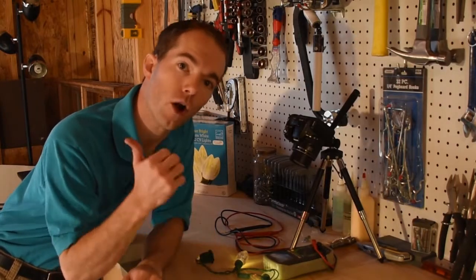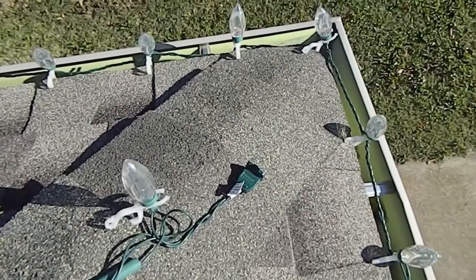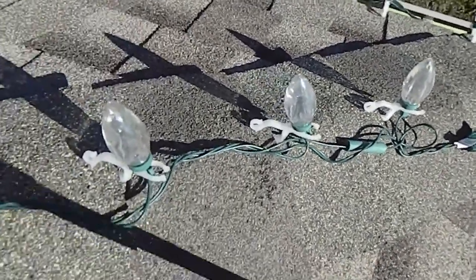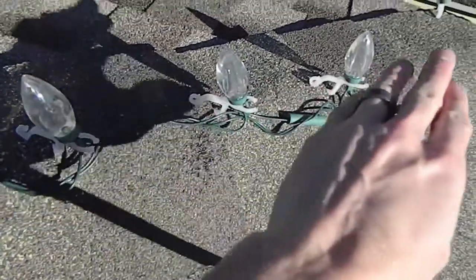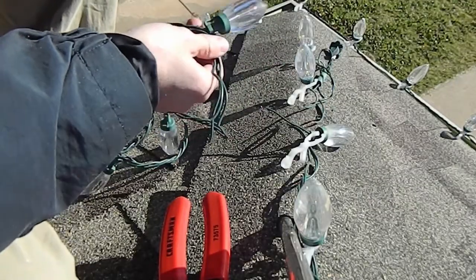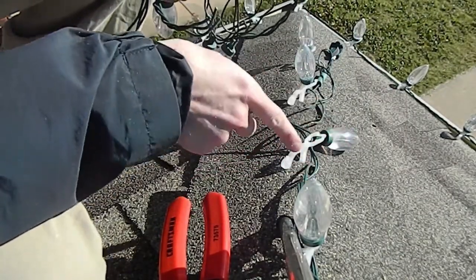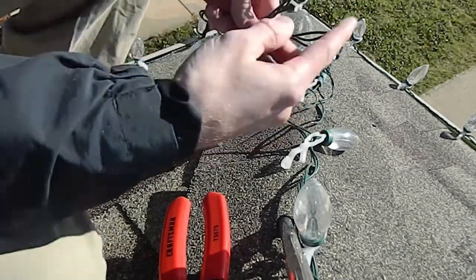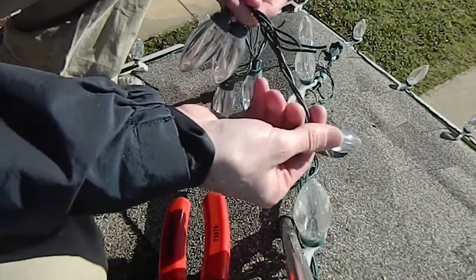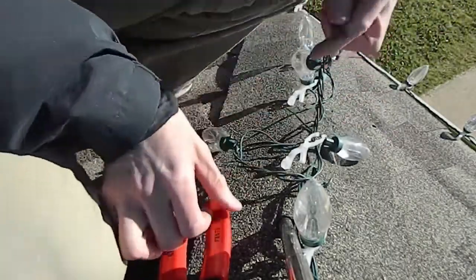Unfortunately the lights I need to splice are up on the roof, so I'm going to do it up there. You can see the problem — my last light is two shingles short from the corner. There's the plug and the resistor I was talking about. I'm going to splice my section right here and scoot those down. Now, one thing to note is where you cut these — I cut my filler strand much longer, almost to the next light, so that when I splice the new section in I won't lose any length. If I just cut it right in half it could end up short and the job would have to be redone. So I made sure to cut more than I need — I've got an extra inch and a half on each end.